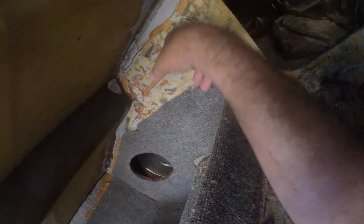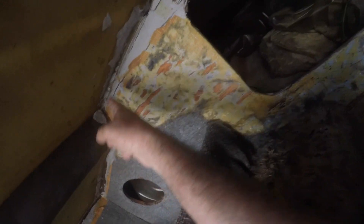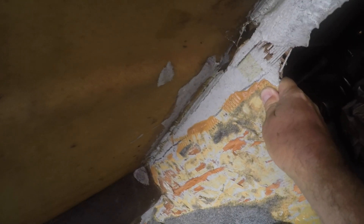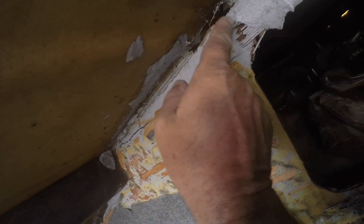I was going to put a piece of wood that basically goes from right here, a few inches down, covers all this, comes to this side. Use construction adhesive and glue it to the back, then just fiberglass the front. These things only get tabbed in so it's not major structural - it just broke at the tab right there. You can see where the tab broke. That needs to be repaired, that needs to be repaired, that needs to be repaired. It's not even fiberglassed up here because it's just tabbed in the corners - all that's still strong down here, that's rock solid.